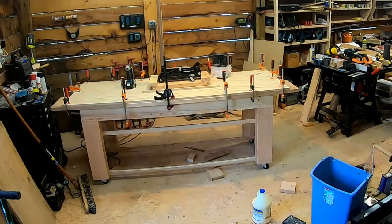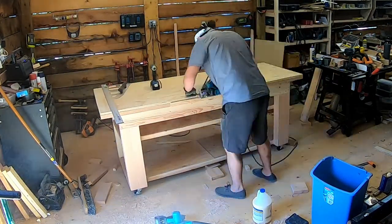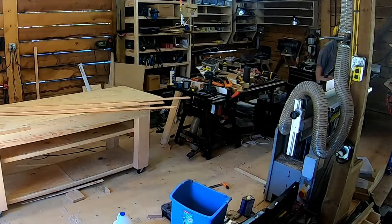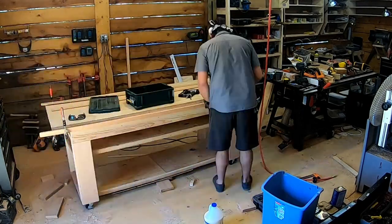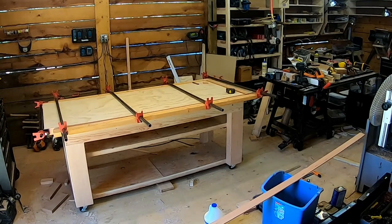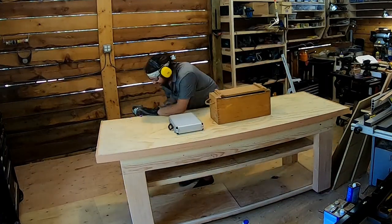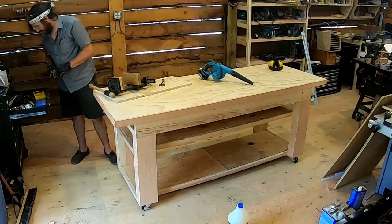The next day I took all the clamps off, trimmed all the wood around the outside of the bench, and then used a flush trim router bit to true up all the surfaces. At this point the bench is basically usable, but I wanted to make it a little nicer, so I ripped a couple strips of fir, planed them into nice thin strips, and put a mitered trim around the edge to block all the strange glue-ups and give it a little fit and finish. Once that trim was dry I gave it a little chamfer, did a little sanding, and began to test-fit the vice.